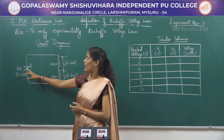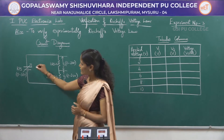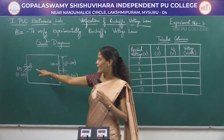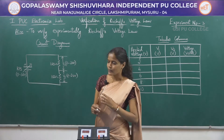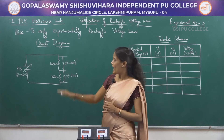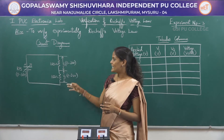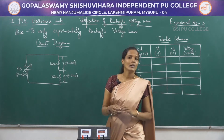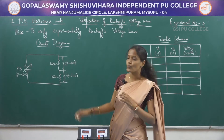For that, we are going to use this circuit diagram where this is the RPS, that is the regulated power supply — DC regulated power supply. This is plus and this is minus. I have written an arrow mark across the power supply because I will be varying the voltage of the RPS. For this experiment, we will be using two resistors, each having a resistance of 100 ohms, connected in series. The voltages across these resistors will be measured and named V1 and V2, using DC voltmeters each having a range of 0 to 20 volts.